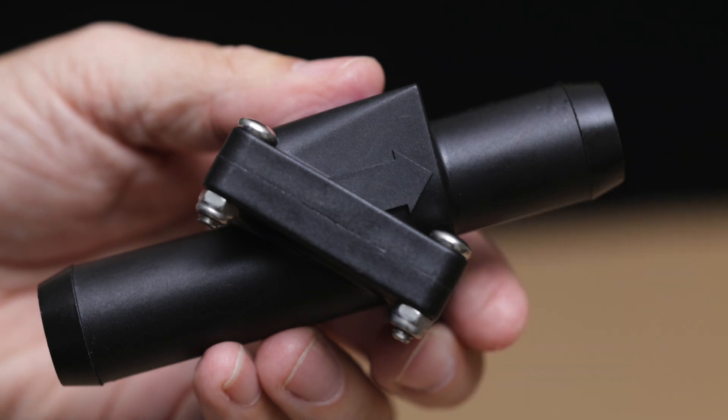These valves can become clogged, so if you find the pump is not priming, remove, inspect and clean, or if needed, replace the valves.